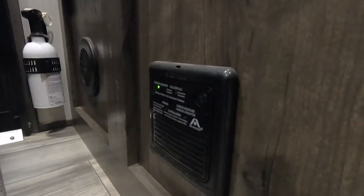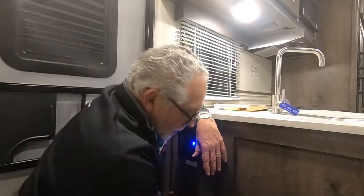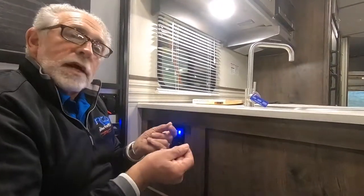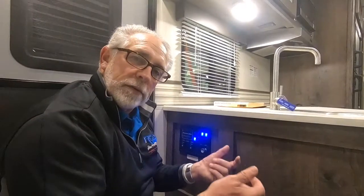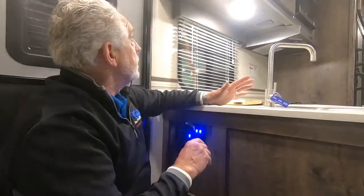Down at this level is your carbon monoxide sensor. It's hardwired — it doesn't run off a battery — and lasts about five to seven years. When it starts to go bad it'll beep; push the button to quiet it, then take the two screws out, disconnect the two wires, get your replacement, couple the wires back, put the screws in, and you're good for another five to seven years.